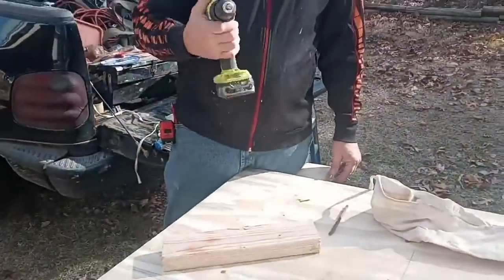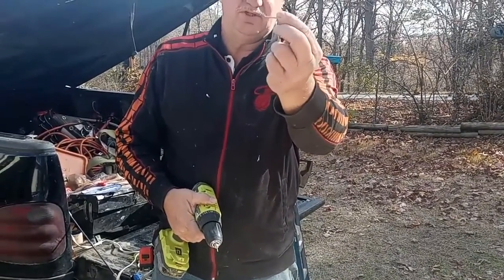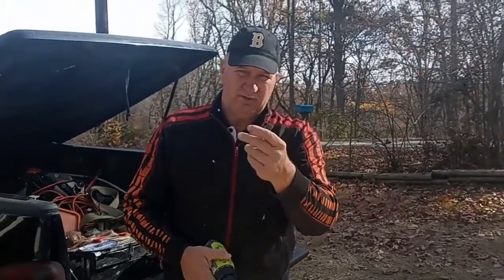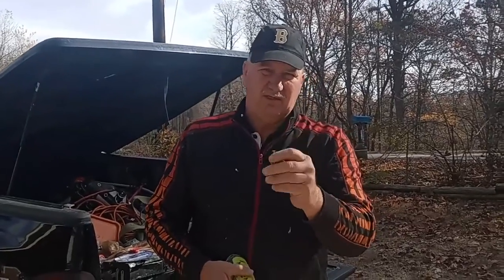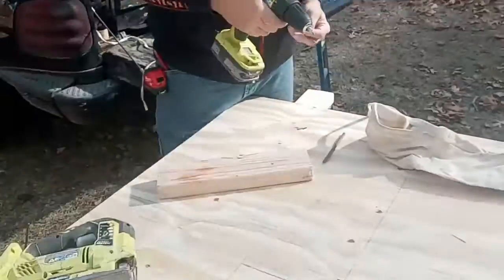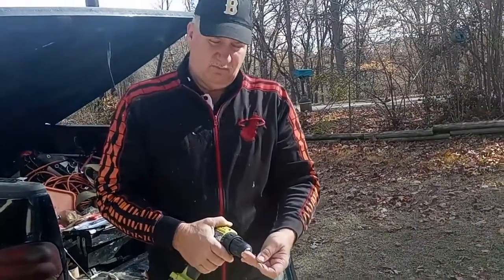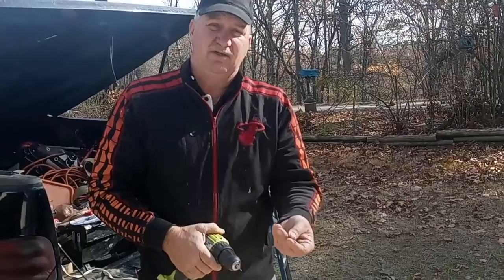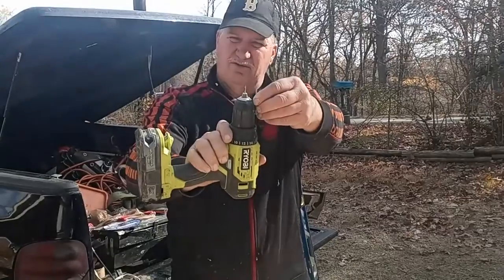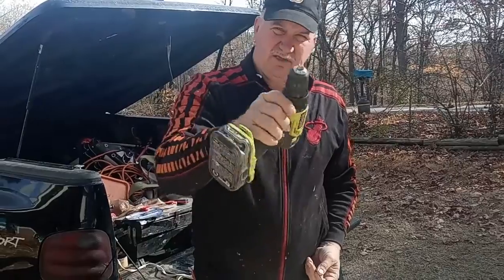All right, one of the tricks that I've learned is, if I'm putting a nail into something that's very fragile, like a real small piece of wood, but particularly with concrete board, Hardie board and such on the siding, we literally put one of these nails in here and pre-drilled the holes so that we wouldn't break the concrete, which is very hard, when we drove it in, and it made it easier to get in. So you might use that nail that is the exact size inside there, and then you can hammer it without much trouble. And just thought I'd let you know.